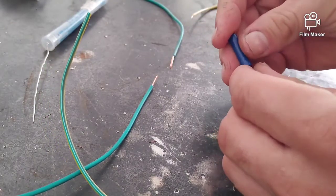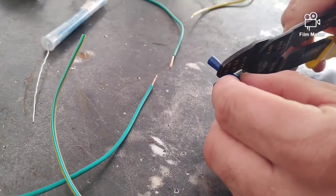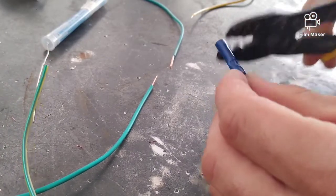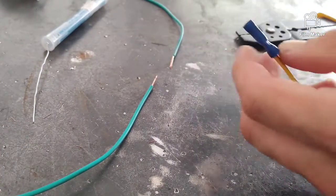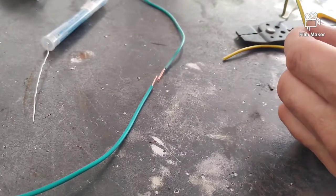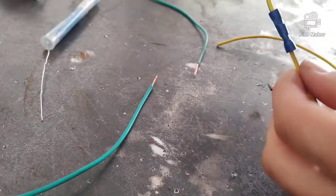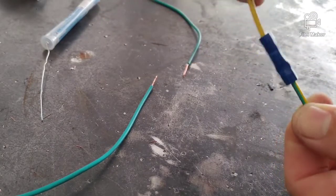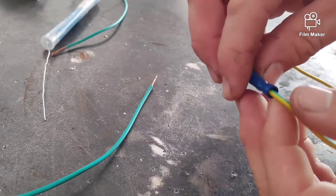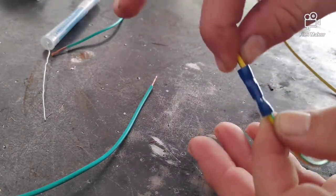First, with this yellow wire, I'm going to put my crimp connection in there. You always want to use a crimp tool designed for crimping — you don't want to use regular needle nose pliers. I'm pushing that wire all the way in until the rubber insulation bottoms out on the metal inside. I've read online where they claim this keeps water out, but that's not true. If you've ever worked on a trailer with wiring, you know water is going to get in there, corrode away, and these eventually get loose and just fall out.